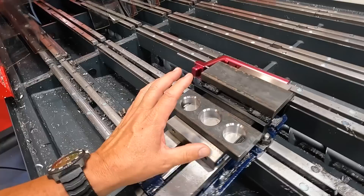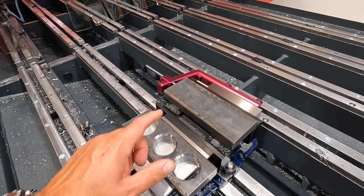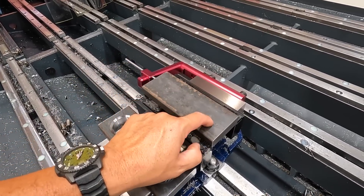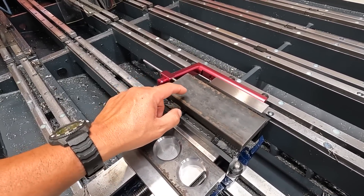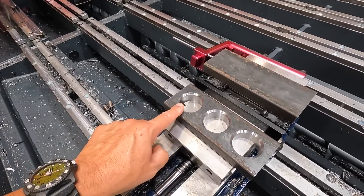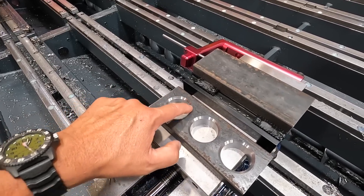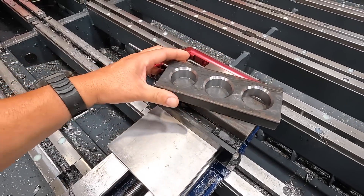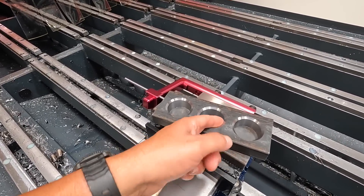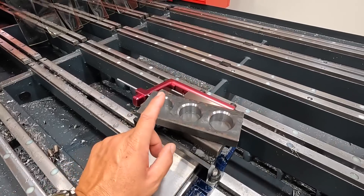I also made another change from the previous run. First thing we're going to do is take a one inch Drill Meister carbide tip drill, pop three holes in there, then come in with a five eighths diameter roughing end mill solid carbide — rough it out using a spiral pattern, leaving about twenty thousandths on the ID to finish. Then a three quarter inch four flute carbide end mill will make a couple finishing passes to bring it to final size. I have that dead nuts on the tap size: 1.781, and I've already mic'd it with a telescope gauge — spot on. Used a little bit of wear compensation to get there.